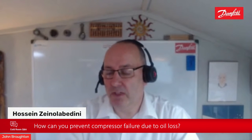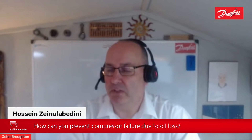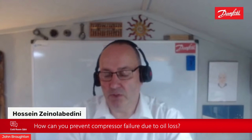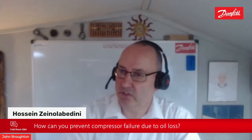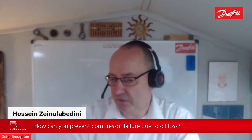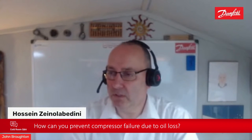It has to be said, commissioning is also important — and I come back to this word quite a lot. When you start a new installation, commission it, run it up, make sure it's working. Then maybe five days' time, come back and check the oil level. Is the oil level okay? If it's not, top up the oil level. Come back a little bit later and check again. Just keep a check on it for the first few weeks of that installation to make sure that it's not carrying over too much oil.